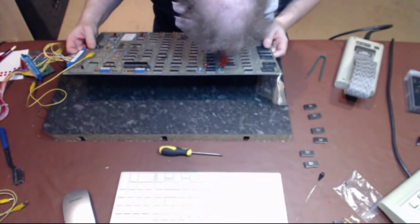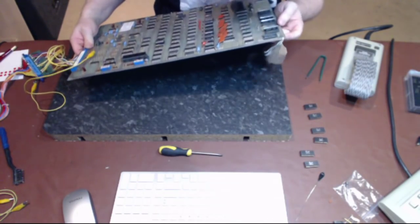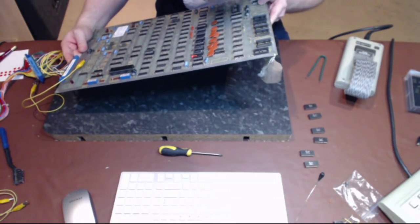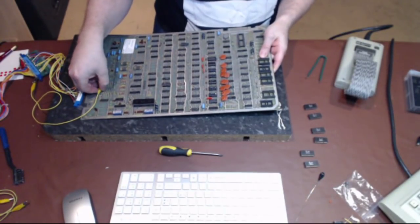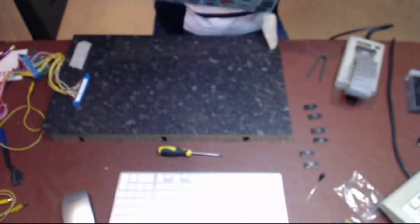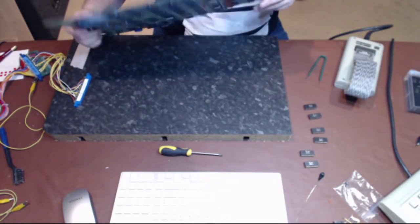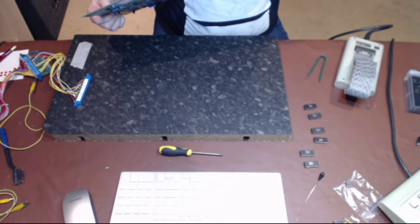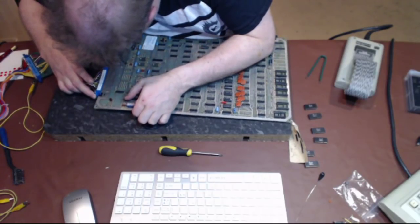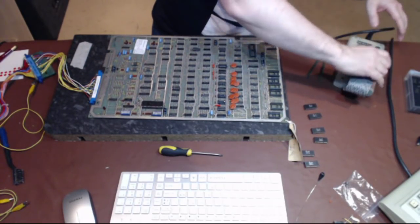Can I see anything going on underneath them? It's one of those times when you wish you had a compressed air machine at home, because it would actually help with this. A little miniature wind squisher. Okay, let's have a look on the back of the board in case there's anything weird going on there. Could be one of these 244s failing. Yeah, some smoochy solder that somebody's left from a previous board repair attempt. Reset button's got quite long tails on it. Nothing really of major interest. Okay. Let's plug the socket connector back in, our edge connector. Put the Fluke test probe back on.